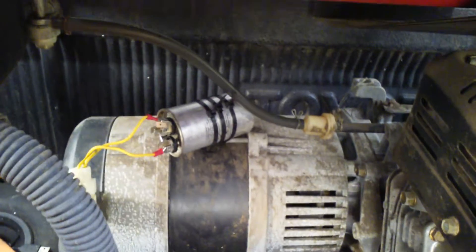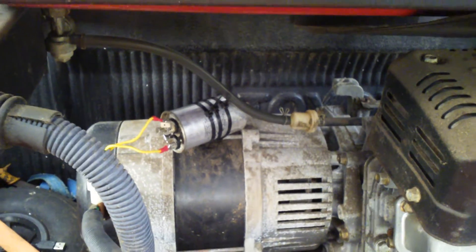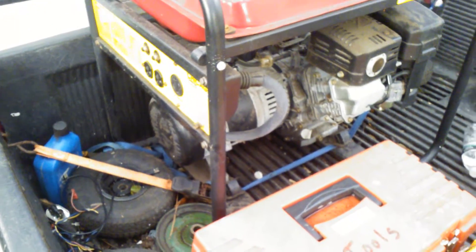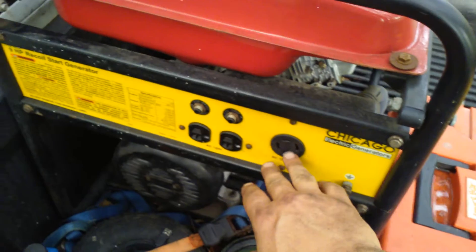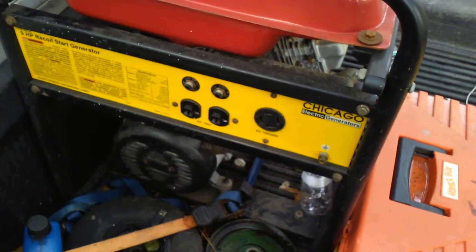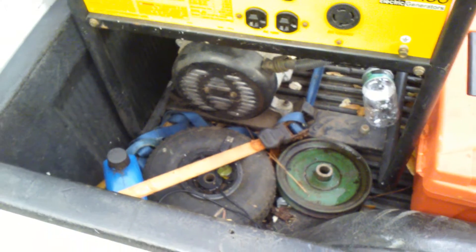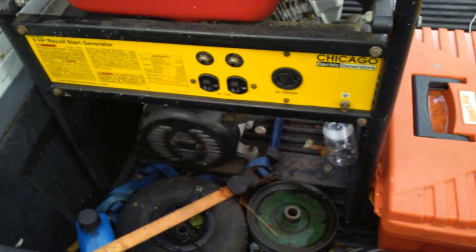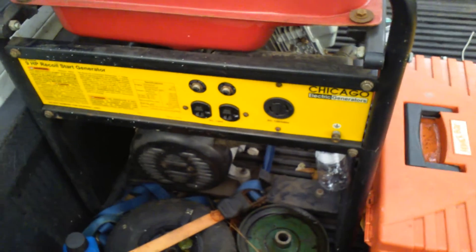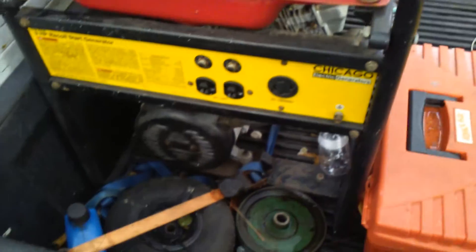It's been running all day, compressor cutting in and out, no problems. If you have a brushless generator not putting out voltage, check it with a voltmeter — I was getting like 5 volts on each leg and about 11 to 12 on the 220. That's it. Check your capacitor. I safely bumped mine up from 35 to 50 microfarads and it worked just fine.